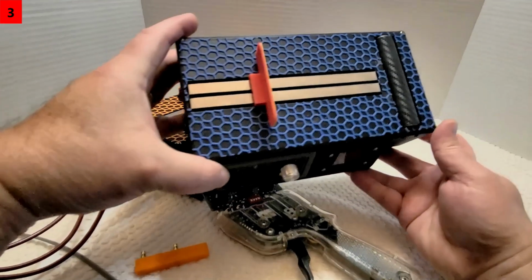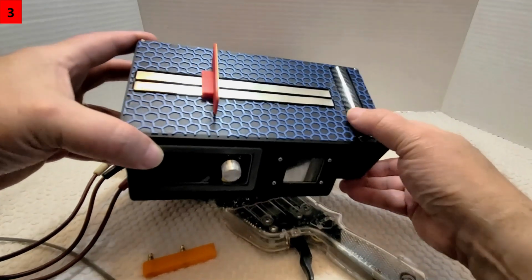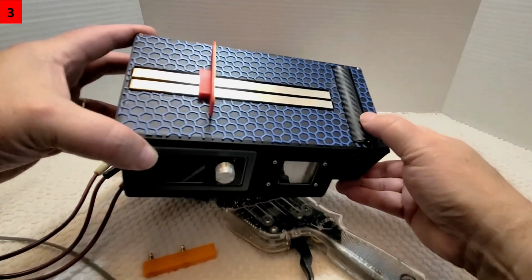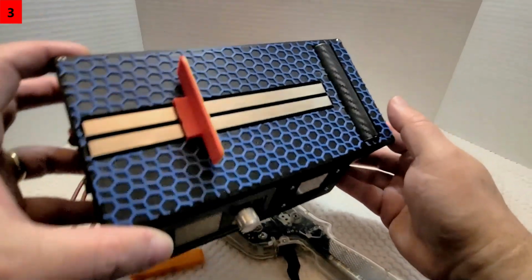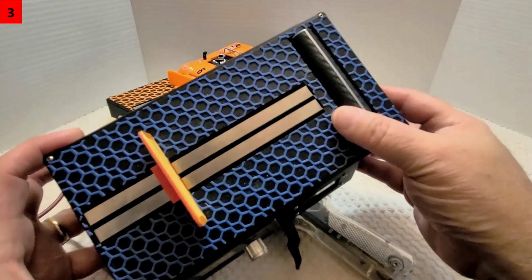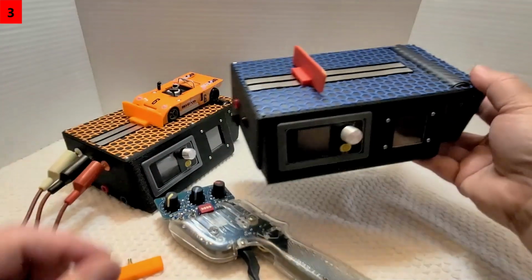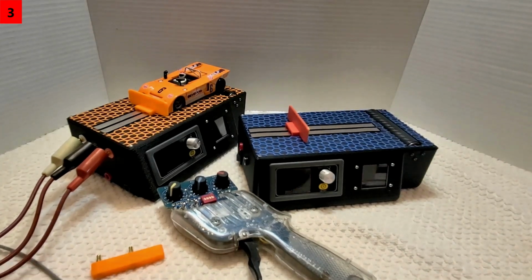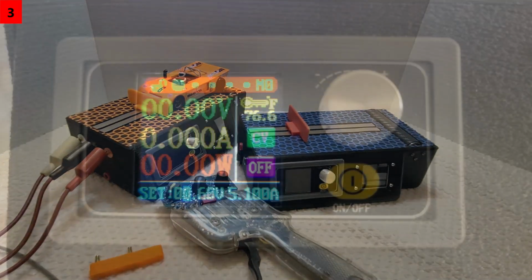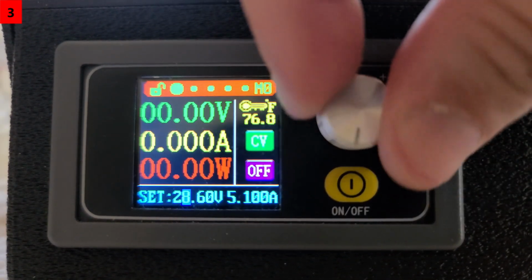We'll start with the 20mm balanced aluminum roller that is mounted on two high-speed ball bearings and a 5mm hardened lathe stock axle. This makes the ride smooth and quiet. The benefit of this feature is the ability to visibly detect problems with your car's drivetrain when running your car at low voltages. By the way, the tech bench allows you to run your car at any voltage from 0.6 of a volt all the way up to 36.5 volts.